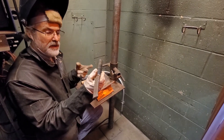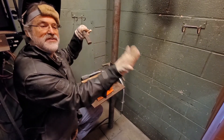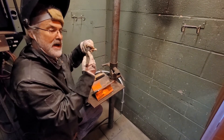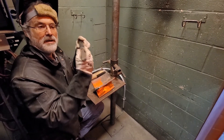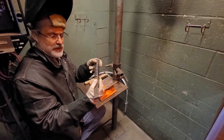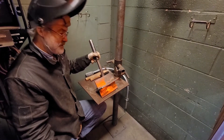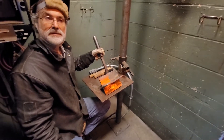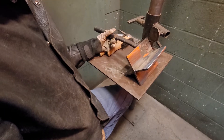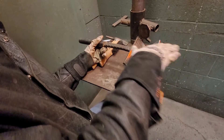When we're welding vertical, as we rotate the handle, it allows us to change the angle that we're welding at by just rotating the handle. But we have to connect the handle on properly. If I tell them to connect it to one of the sides, they'll usually try to connect it just like this — but this is not correct. What we want to do is get the handle basically flat to the floor, or flat to the table, and connect it on flat.